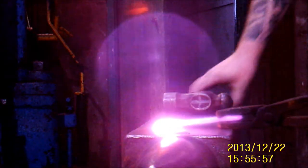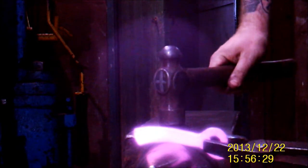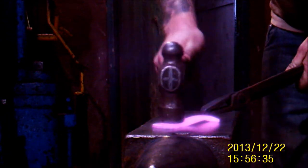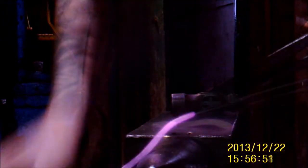Now I'm going to put a bit of shape into this bottle opener now all the flat bits are done. I'm going to use slightly bigger hollow bits, place them on the anvil, then put the bottle opener on the anvil and tap just behind the neck and use the bit to round the end off. That makes it a bit more tactile in the hand. There we go, lovely — nice and flat. Then whilst it's hot get some dark furniture wax on it — it's like a beeswax — just get a cloth and give it a good rub to get it nice. And that's it, there's a bottle opener. Thanks for watching, see you next time.